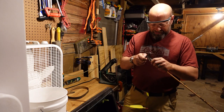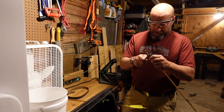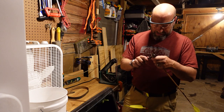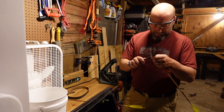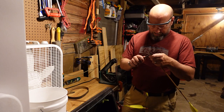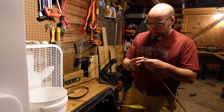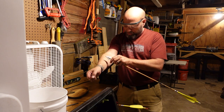That one there, still a little bit. These are hard, like this A7 tool steel, 58 Rockwell. Well, I mean, this is some tough steel. You've got to work it there for a sec. Let's see. There we go. Now we're hitting good. Take that edge off that side. There we go. Take this side. Okay. See how that is now without stropping. There we go. Now we're popping those hairs right off.